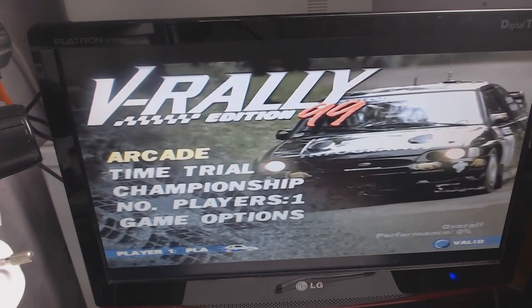The Nintendo 64 that I picked up a few days ago, when you connect it to the TV, it's really bright — the whites are very, very bright. So what I'm going to do today is open up the video lead and solder in a 75 ohm resistor onto the video to ground, and try to bring that brightness down.